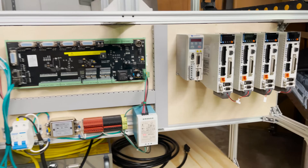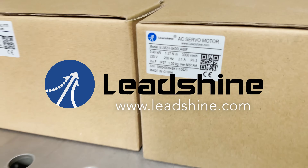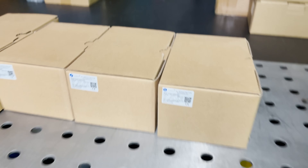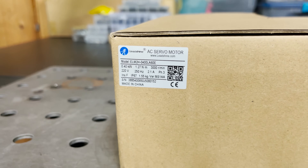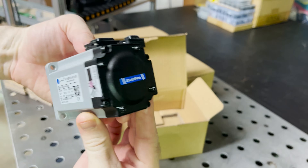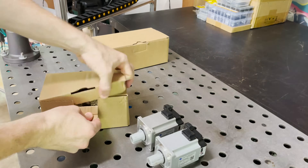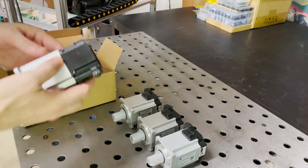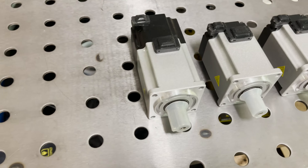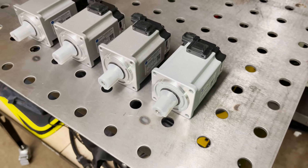The spacing looks good and everything looks vertical. Let's take a look at the motors — LeadShine sent these ELM2H 400 watt motors for the project. I have three of those and then one that has a brake on it for the Z axis. So we have our Z axis motor, X, and two for the Y axis.